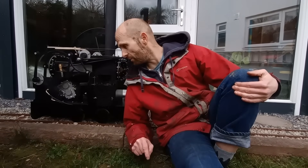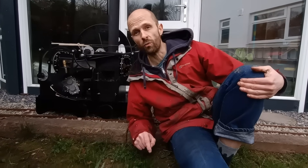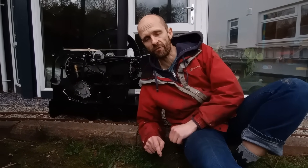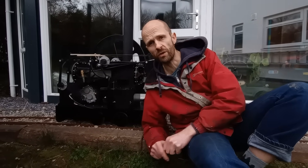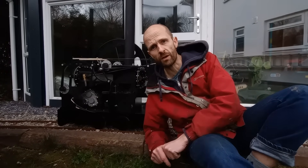We've had the engine running around the garden, but unfortunately there isn't a great deal of heat in the firebox. I've been running anthracite coal, which is a high-grade coal with a lot of energy in it. The problem is it needs a lot of draft to really get the heat there, and this chimney is quite short — it doesn't seem to have a great deal of draft. Last time we used smokeless coal, the modern brick-style stuff, and that seemed to get a lot of heat. We're going to abandon the test for today and come back with a different fuel.